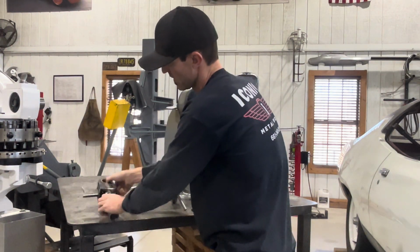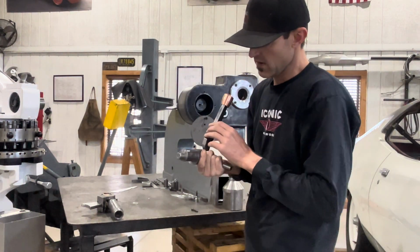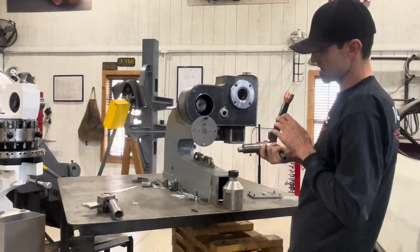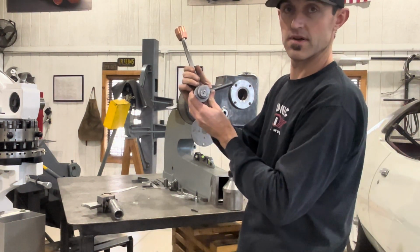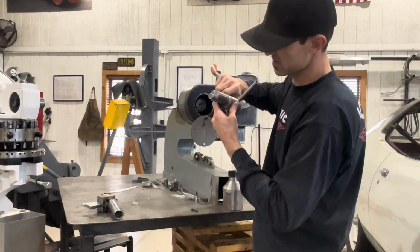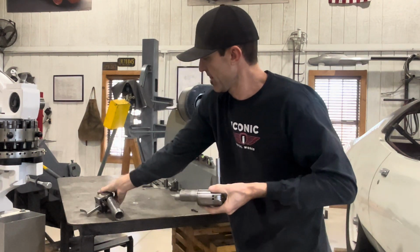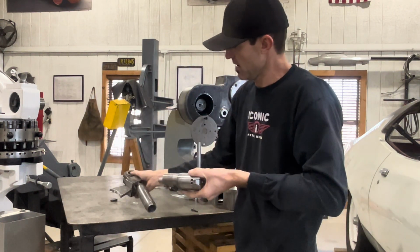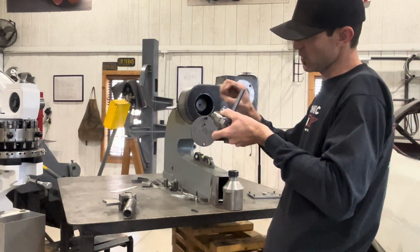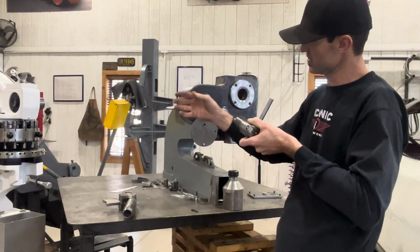That particular one where the bushing is, it rides on this cam. This cam is offset, so you can get different strokes. It basically starts out up top, as you can see, and then what happens is you start to rotate it down. Obviously this is going to be a mirror image. It starts swinging this particular center. It swings it on a pendulum, so as it pulls further away, that's where it's over here. You're going to get your maximum stroke.